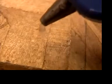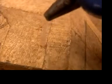There is a trick to getting strong connections with hot glue. If you just lay a blob of hot glue on a piece of wood, it'll sort of stick. But with your fingernail, you can just knock it right off, and no trace remains. But if you can smush and push the glue into the wood fibers when it's still soft, the glue gets a good grip on the wood.